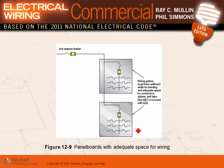Here's another way of doing it. These are cheap ways of doing business. Instead of having a main panel, they have a circuit breaker like this one here, and the same thing. They come from the first panel and go right through this panel. So you have to have enough gutter, enough room here for the conductor to go from one to another. This will be 200 amp here, and this will be 200 amp here, so that the 400 amp will go right through the gutter and feed both of them. That's another way, but you have to have enough room.